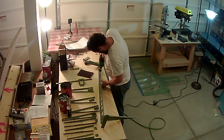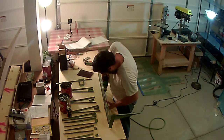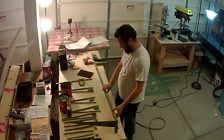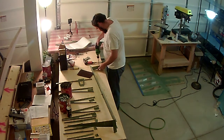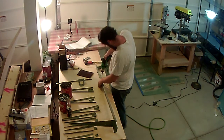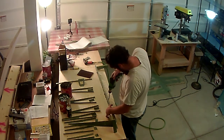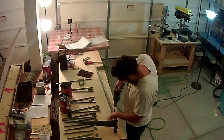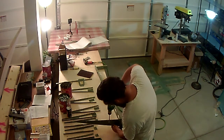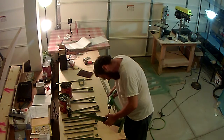As I edit this video I have just completed the majority of the rudder. I was able to get the trailing edge done correctly with the correct tape and just did the double flush riveting, which is a lot easier — at least for me — than it sounded. Whether I did it correctly remains to be seen; I'm going to have someone from my EAA chapter come over and take a look. But looking along the trailing edge it doesn't seem to have much of a wave, if any, so I'm pretty pleased. Running my finger along the machine head side of the rivets, they seem to be flush mounted pretty well on the backside too.